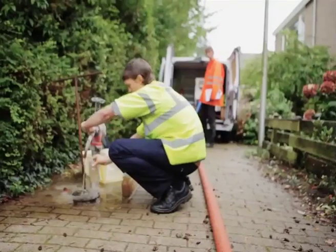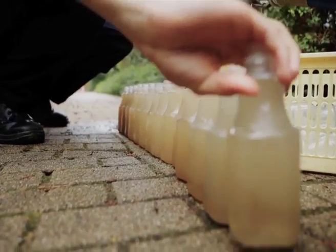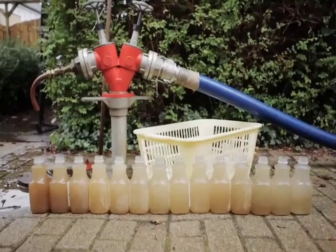There's been research done by the University of Bristol that shows that ice-pigging can be up to a thousand times more effective than water flushing alone. Ice-pigging is a far simpler, far more straightforward process that doesn't require excavations in the way that a swab would need to be inserted. You also use less water than a technique like flushing.